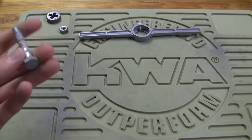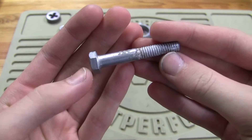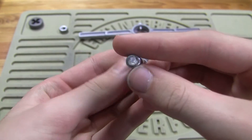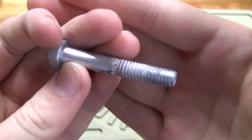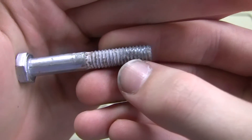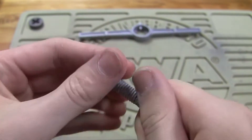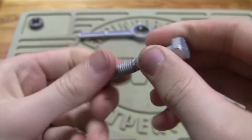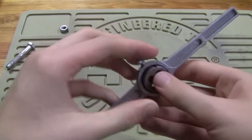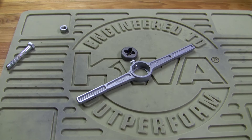We have a little project I'm going to show on camera. It might not be too interesting to some people, but others it might be. Basically, we have this bolt here — it's about 5/16ths of an inch. Hard to see on camera, but right there the threads are kind of mashed in, so this nut does not screw on all the way — it stops right there. I need this bolt for a project, so we're going to use a die and clean up those threads. I'm going to turn around the camera, go over to my vise, and we can get started.